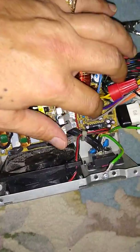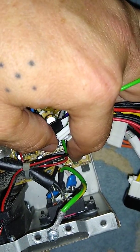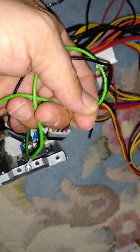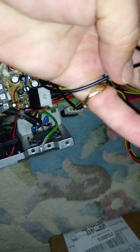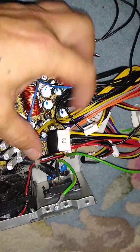When you take the top off, look on the board itself and you'll see right there where it says PS_ON — power source on. All you do is grab one of your black ground wires, doesn't matter which, and just cross them — butt connect the two together. That's all.